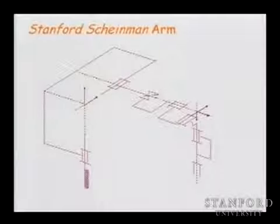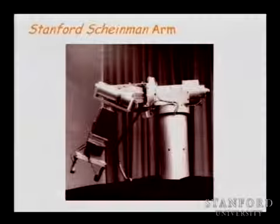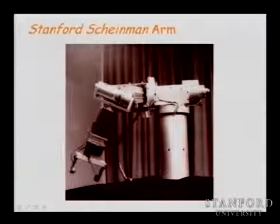Now the last 3 joints are going to affect the orientation. When we move the structure, the intersecting point is here. So this point is the intersection. This structure rotates about this axis. It rotates about this axis. This is joint 5. So joint 4 is like this. Joint 5 is along this axis, and joint 6 is along here. So if you put your hand here and rotate this, you rotate about the z-axis. If you pull it out, it will rotate about this axis.